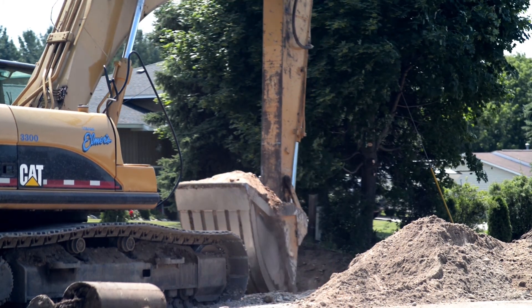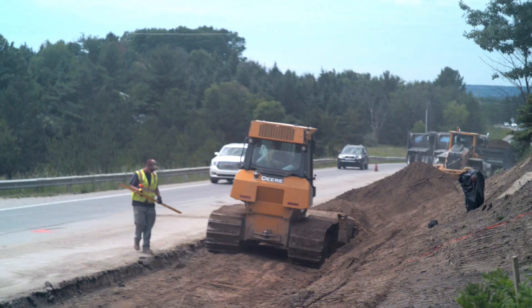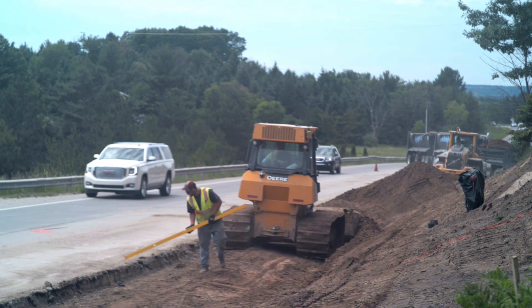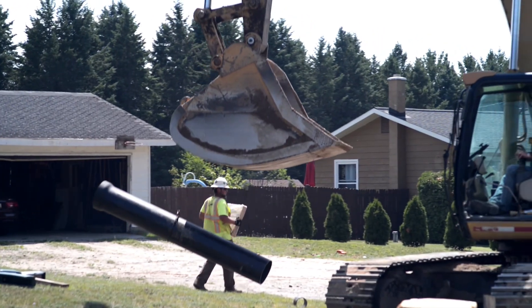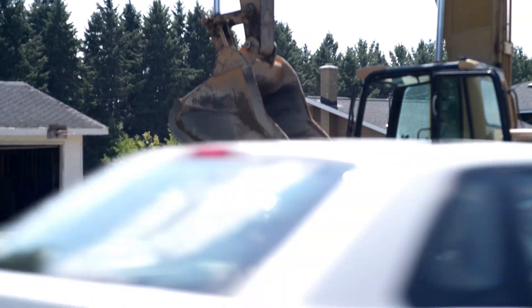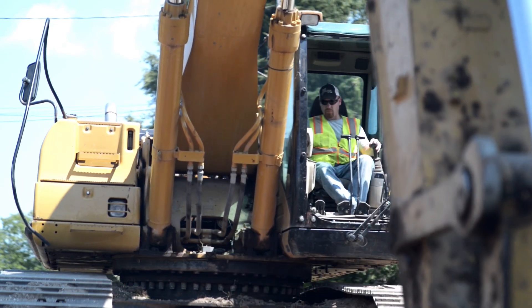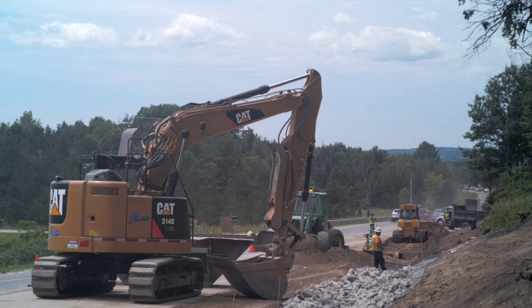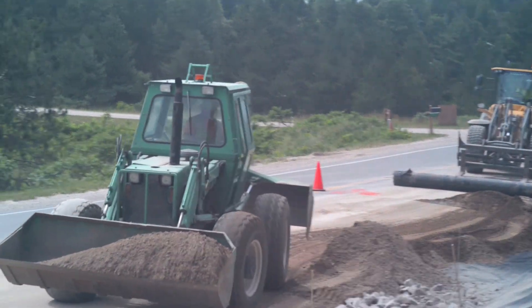If you choose to go to municipal water, you're welcome to it. It's just a transmission main for now, and we never hooked up one house. They wouldn't even allow them to talk about hooking up until we got this done and the water tower's up and pressure reducing valves are on line — and then if somebody wants a water service, they'll have to tap the main and go from there. The biggest thing with the water main was creating a loop so if something happened to the water main, there's a way to back feed into it.